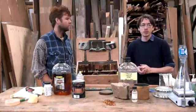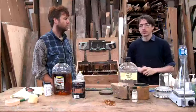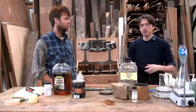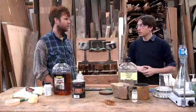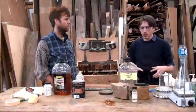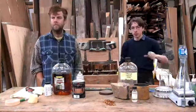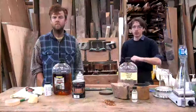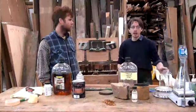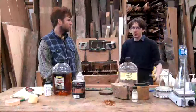Yeah. I would probably look to cleaning it thoroughly, using some detergent and soap, or even turpentine. Mineral turps. Sugar soap? Sugar soap's a bit heavy duty. Sugar soap potentially can damage the shellac. Yeah. So cleaning it off with something a little bit more gentle, getting rid of any wax, and then reworking it with metho and sandpaper first, or doing another light coat of shellac in a method I'll talk about later. It's hard and it doesn't always go well, but why not try?